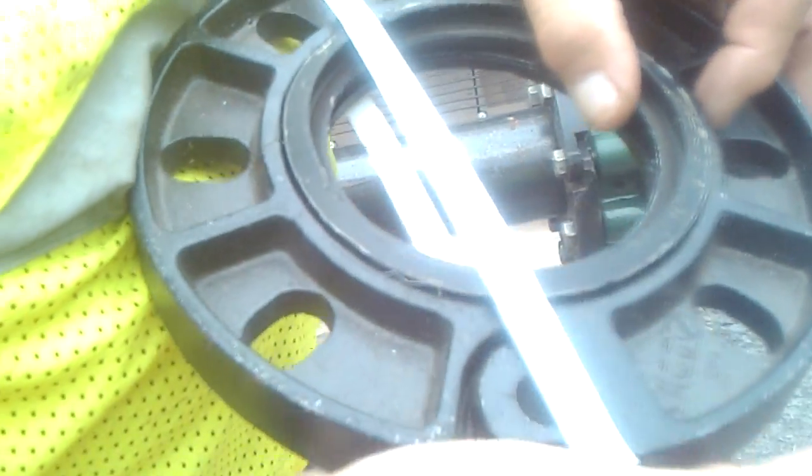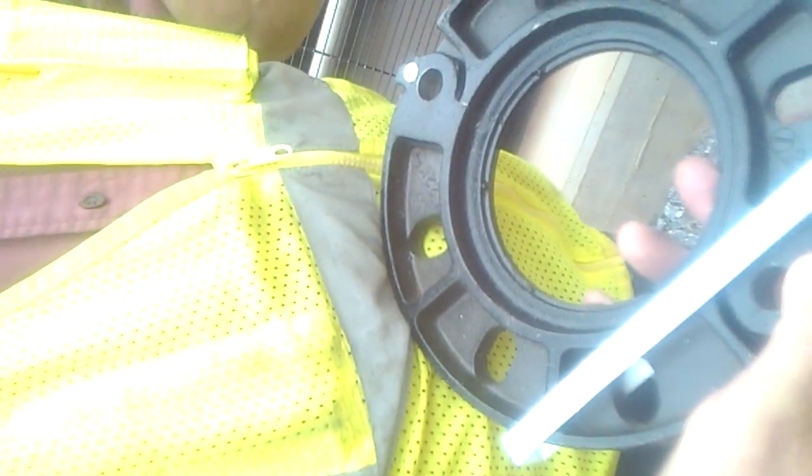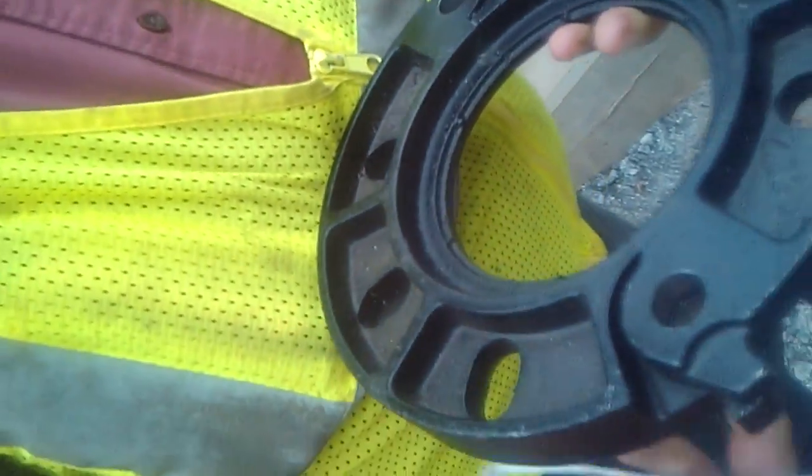Ronnie, you want to start out and tell them what our problem was? Our problem was we had all these flanges put together and the gaskets put in backwards. This is the gasket we're talking about right here. These gaskets were installed incorrectly, with the beveled side into the flange. These will not hold in this position. Can you turn it up about like this, and then set it back in the wrong way to put it in?